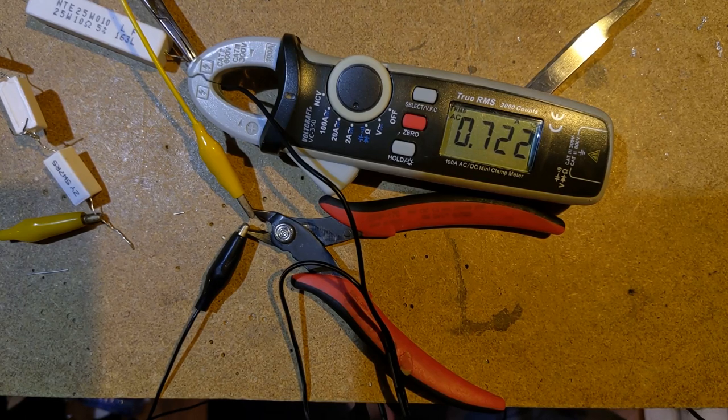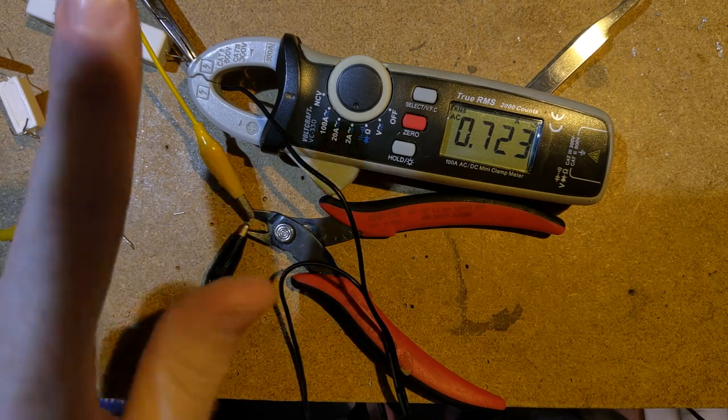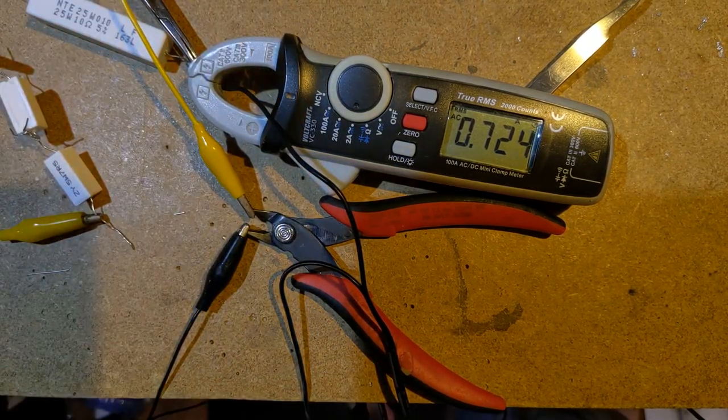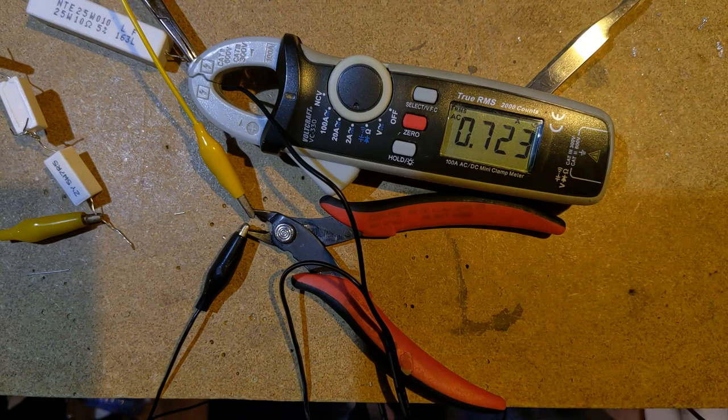So, what am I expecting here? The electrical current, and thus the magnetic field in the side cutters right now, is flipping back and forth, back and forth, back and forth. When I turn this off, hopefully all the molecules are going to be all kind of mixed up. They won't be magnetic anymore. So let those run for a little bit.